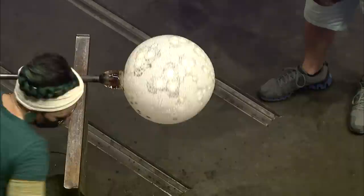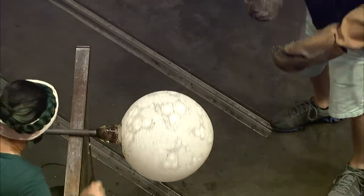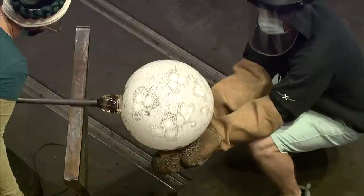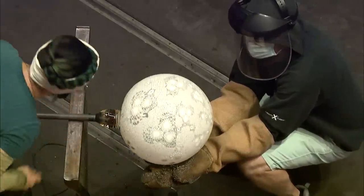She might apply a little more water to it. And what water does at this stage is create little stress fractures. But she will fire polish that break off with a hot torch right before we put this one away. Here's the water. We're really careful when we do this move not to let water touch the actual piece. One little drop could definitely ruin it.